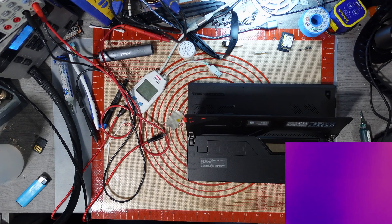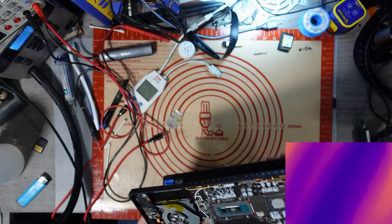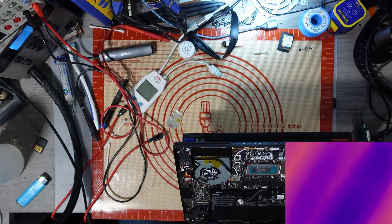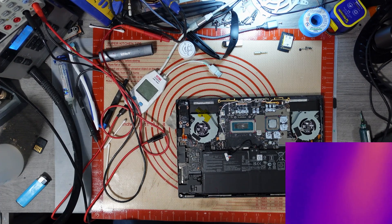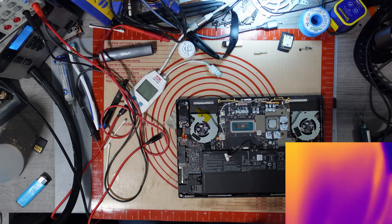This definitely isn't a cheap Ali tablet — this is like a couple of grand. An RTX inside a tablet, that's not cheap. I'm not seeing any schematics. Let's see if there's a part number on the board. It's one of two things: it's either that MOSFET or the CPU. If it's the CPU, it's game over because it's not going to be worth fixing — well, it would be if you could find a working CPU. I'm not going to find any replacement motherboards for this laptop, that's for certain. Replace the MOSFET, and if it's still dead, then it's CPU.